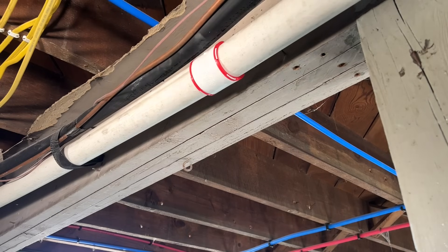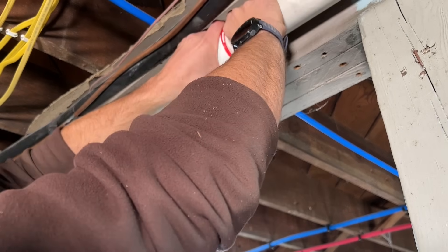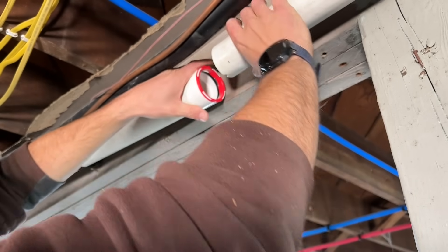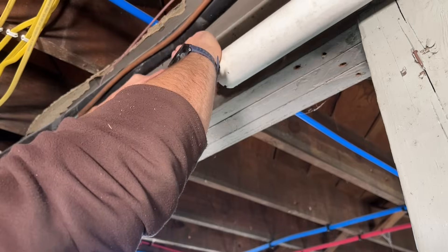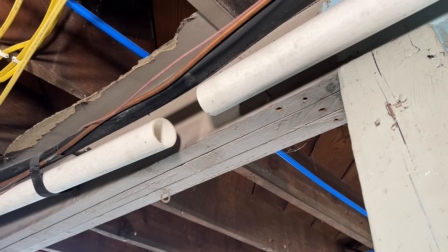As I prep for option two, this will show one of the cool little features on the push-to-fit coupling: it's removable. All you have to do is do some small twists of the pipe and it will pull right out of the coupling. Now you can see on the outside of the PVC pipe the teeth that were kind of grabbing into the outside as we twisted and removed.